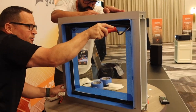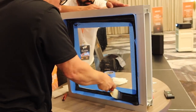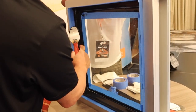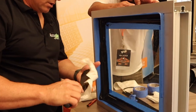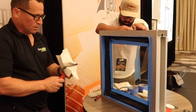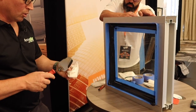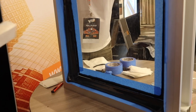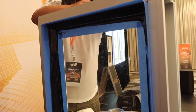I've got to reposition myself so I can stay at 45 degrees. Now this corner where the tape peeled earlier is going to be a little messy. I got a message from a guy that bought my tool kit — he said the plastic tools weren't as smooth as metal tools. Well, it doesn't have to be really high gloss. You don't have to polish this stuff out. We're trying to put a proper bead down. We're trying to put down the proper bead without anything concave and getting that hypotenuse as straight as possible.